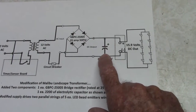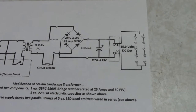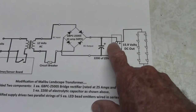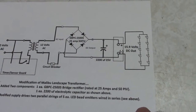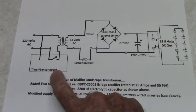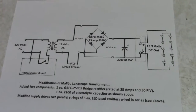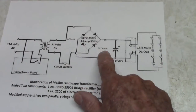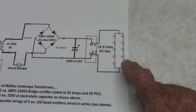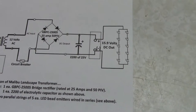I also added a filter capacitor to smooth out the ripple caused by the rectification of AC to DC. Everything still comes out the old terminal block on there — that's what's inside this dotted line, the terminal block on the back of the existing Malibu. The control board over here has the dusk-to-dawn timer and everything in it. Everything is standard Malibu except the addition of these two parts. Then on the output, I've got 15.9 volts coming out of that terminal block now, where it was 12 volts AC.